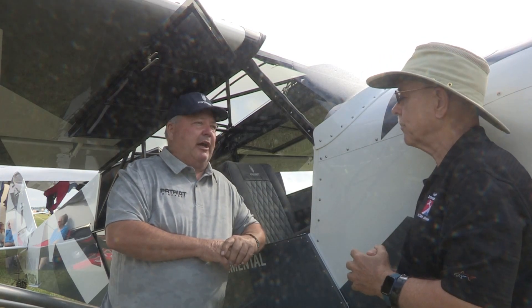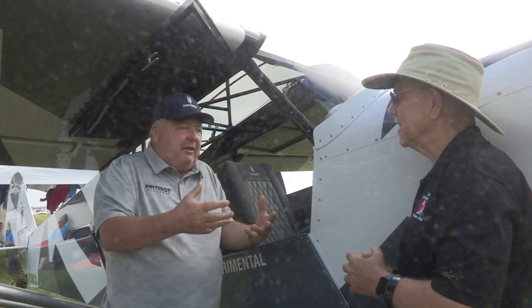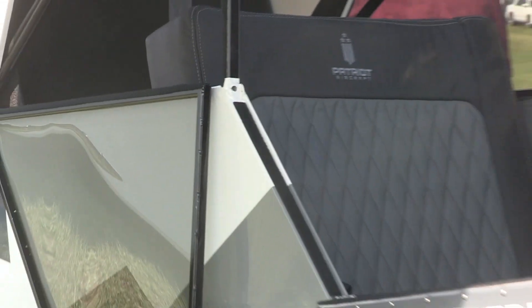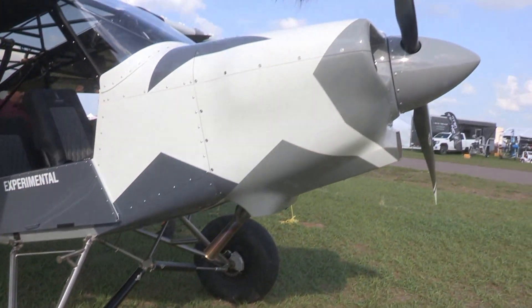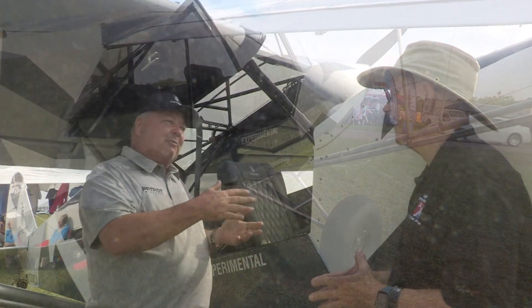You've got to look inside this airplane — the panel is like a fighter pilot's, with everything looking at you. Even the fuel shutoff valves down here are looking at you. Ergonomically it really fits you when you're in there. It looks pretty roomy inside — I can see a gap of about six or eight inches on each side of the seat, and the back seat is a big, wide thing. The cabin width is 32 inches — four inches wider than a normal Super Cub. That's quite wide.